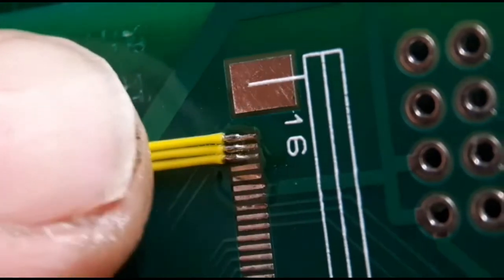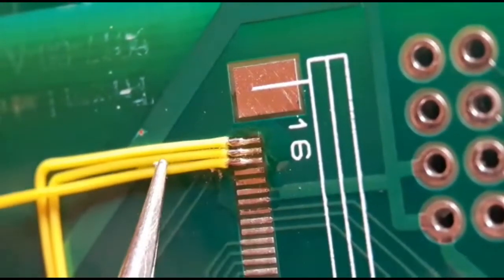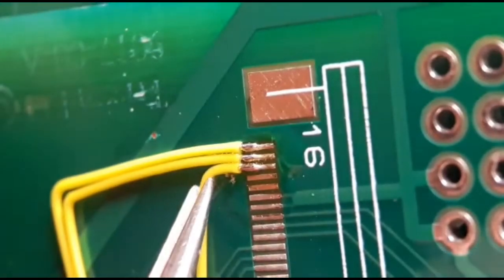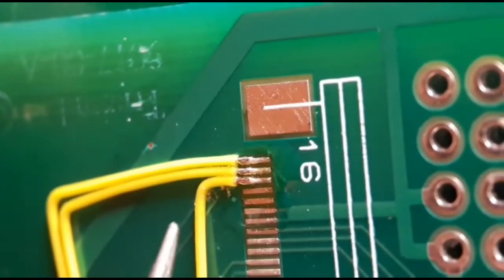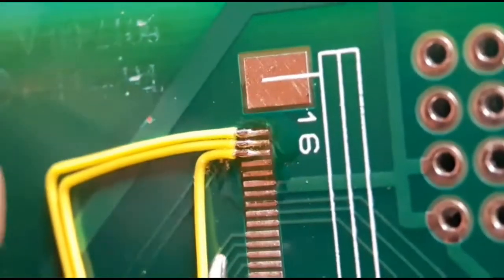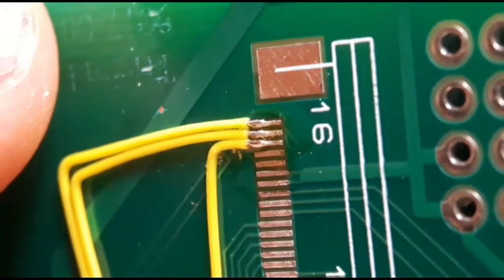You've got that one in there with no shorts — three nice joints. For a close bend, get your tweezers, angle it around, and pinch it into place. If you try to position it bent first and then solder, the sleeve will just shred. So that's the way to do it. I'll bring it over to the other end and tack them into place on the IC.